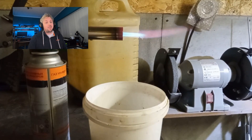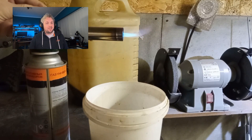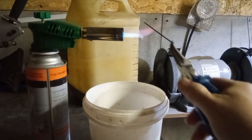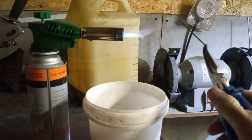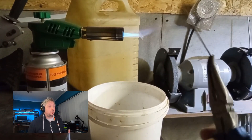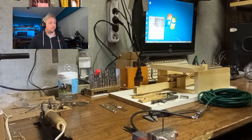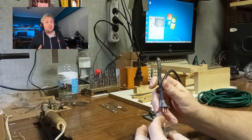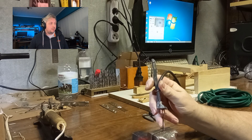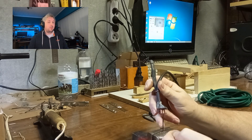We don't know what temperature this has been done at and we don't know exactly what metal it is, so there are some variables to play with. For a DIYer it's going to take a little bit of experimenting — but yeah, it's good fun. We just let that metal naturally cool down; it'd be good to get this into a discreet process. The simplest way to check if this is going to resonate is to clamp that wire in a vice, give it a little pluck, and you can see we can get it to sustain. That's really positive — it's going to do a lot better in a tuning fork configuration once we've got the tone bars in there.